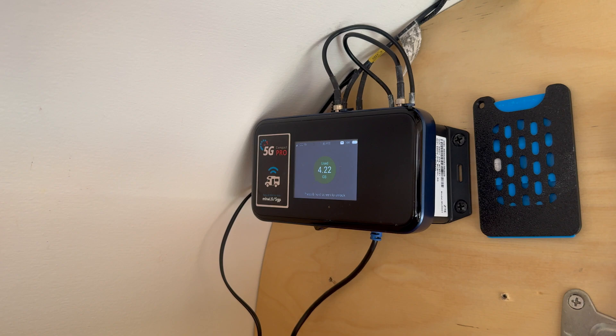There are a million different ways to do it and we have tried quite a few of them. For many years we have used our trusty 5G mobile WiFi, paired with a MIMO aerial on the roof. For the main it does give good signal, however it has its shortcomings - it only has one SIM, so we can only support one network. Multi-SIM networks can work out quite expensive, it doesn't amplify other WiFi available in the area, and it doesn't have failover.